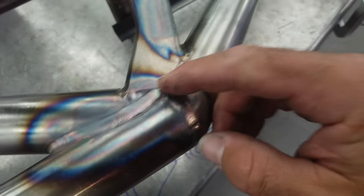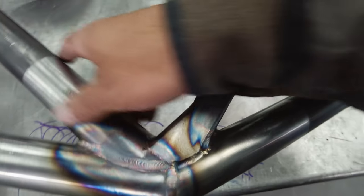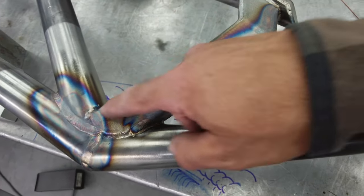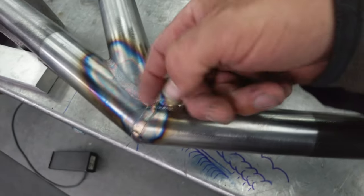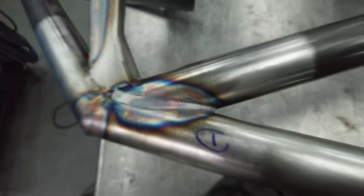Same with this. I knew the miter needed to be done first, so we got the miter portion done, and then I knew that this tube was my secondary, so I ripped that, and then we know that this structure, once I weld this interior seam, then this will want to be welded here. So I hope that overlap thing makes sense to you guys. Same program over here.